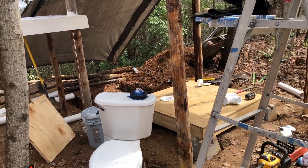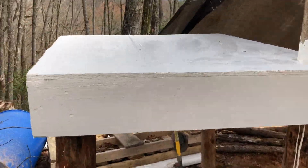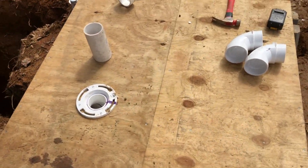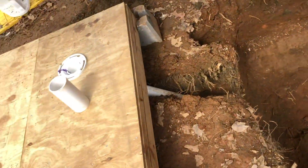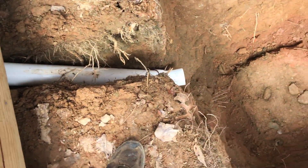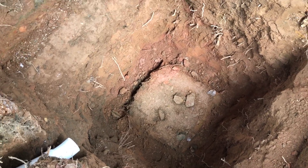It's a little messy right now but we're getting things along. Got the toilet fully put together. We've got our water tank stand right here where the water tank will go on top. We've got the base leveled out and the first initial part's plumbed in, coming down at a 45 degree, into the tank area with another 45 degree to level it back out and go into the center of our tank.